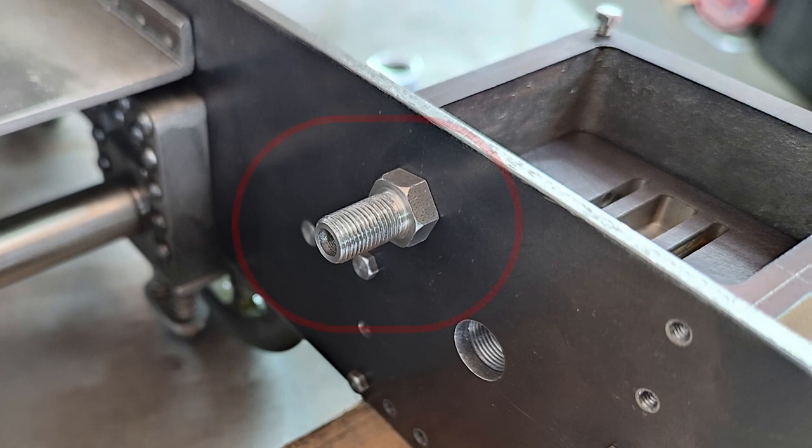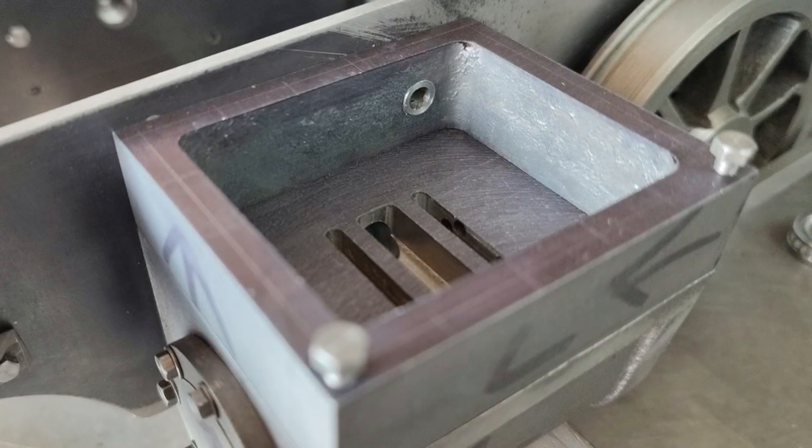When I made the frames I drilled the hole for the steam connection at 7.9mm diameter. The connector, which I've already turned and will come back to in a later video, is threaded at 5/16 by 32 tpi. 5/16 is ever so slightly larger than 7.9mm - closer to 7.94mm - so I ended up opening out the hole to 8mm, no big deal. The connector passes through the frame and screws into the steam chest body. I'm also mindful that at final assembly there will be gaskets fitted, so I'll need a little leeway with that hole in the frame.